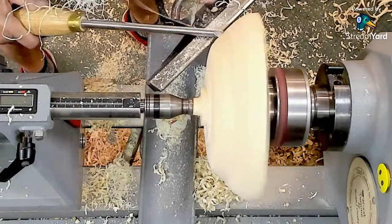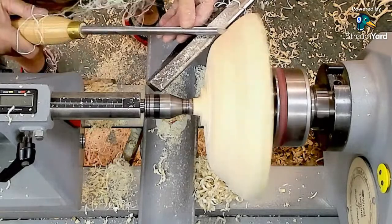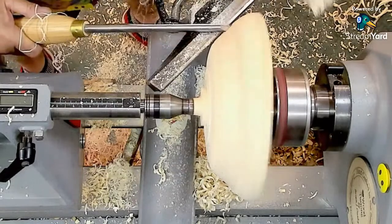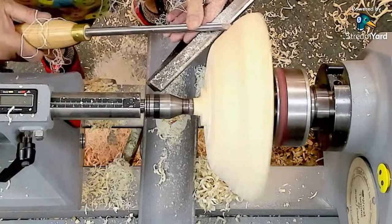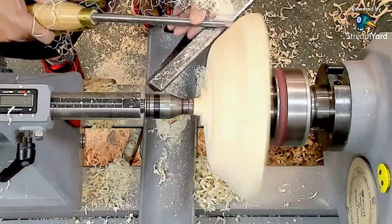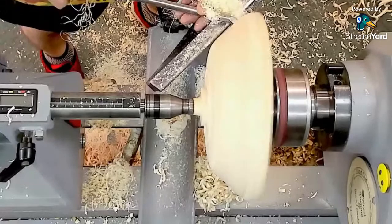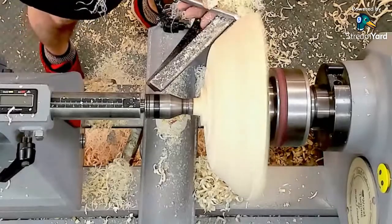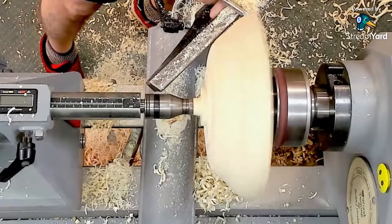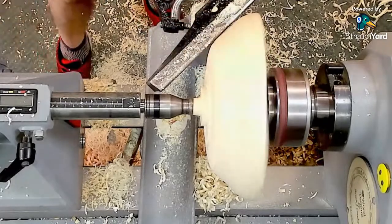So you've got the bevel rubbing. You can do this with no hand, with one hand. So the bevel is nicely rubbing there. And it will get to be a bit funny, because we're going to come out round this corner now. So we'll just bring it on round. And it slips off. That's exactly what I thought was going to happen. So just need to shift my hips from one side to the other and let that come round the corner. We'll be losing a little bit of the height of this bowl anyway. Let's have a look.